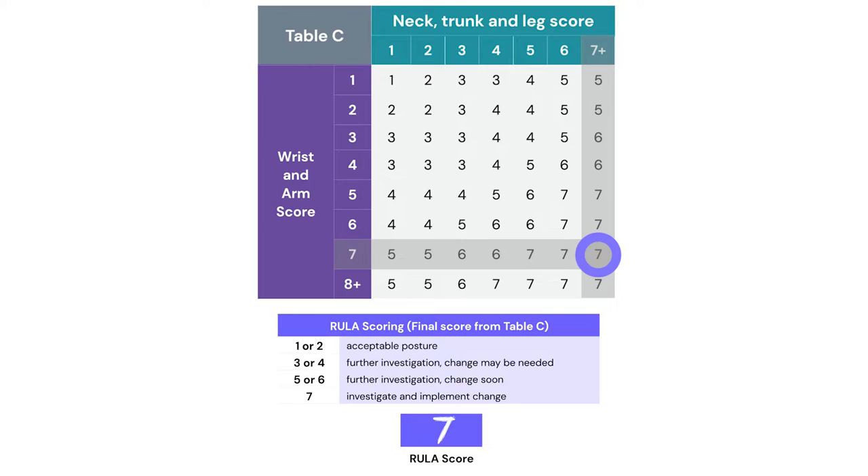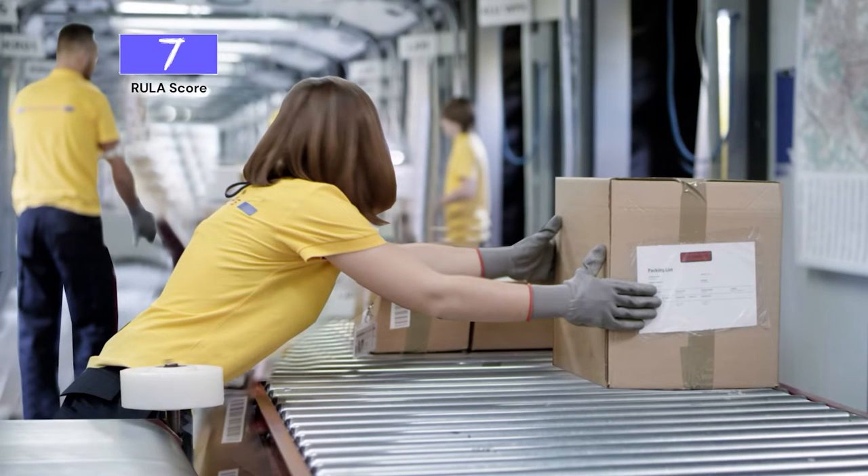A score of 7 means it's high priority if you're using RULA as a prioritization tool. However, if you're using it as an intervention tool, it's good for that as well. For instance, you might realize she's a level 7 at this task — what can we do to intervene? One option is to put a guide on the opposite side of the roller table that pushes and guides the boxes closer to her body. Second, because of her stature, we could give her a step stool so she's a little bit taller, similar to the person in the background. If we take another RULA, we could knock that score from a 7 down to maybe a 3 or 4 — a 50% reduction in relative risk. So you can use RULA to show the effectiveness of your intervention as well as a prioritization tool.